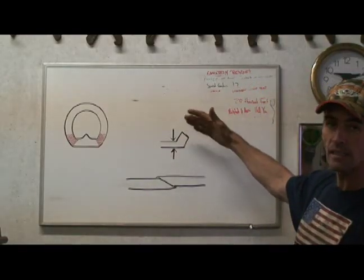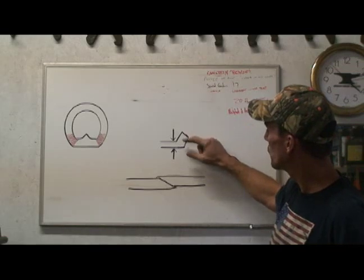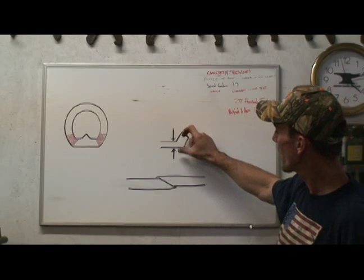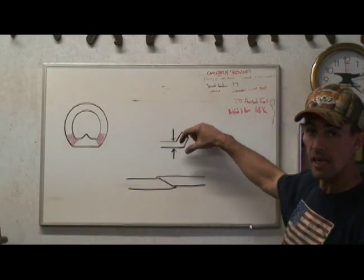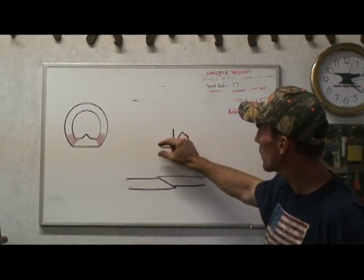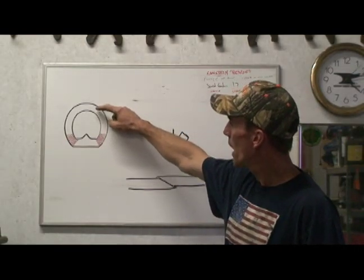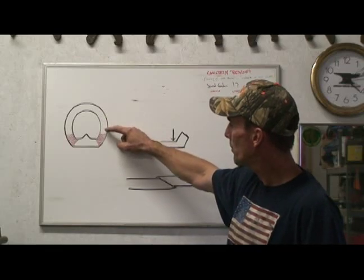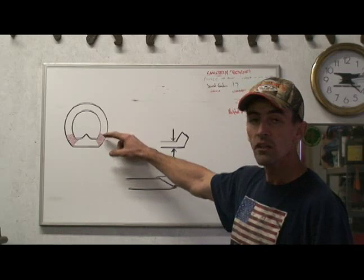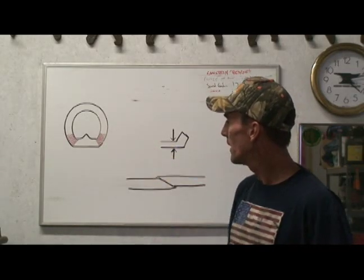Hockey sticking. Hockey sticking is to upset the material back into the corner. If you do not flatten out the inside web of the branch it gets narrower and narrower and it literally does look like a hockey stick — a flat paddle and then the branch is real narrow. The fullering comes down and sometimes people hem too far, which makes the heel area look too narrow. So we want to make sure we upset material in the heel area.